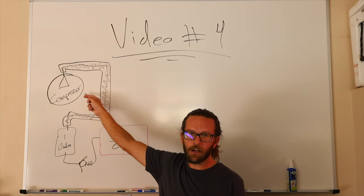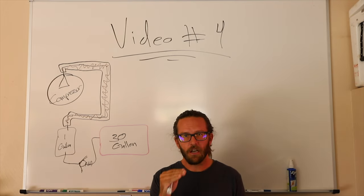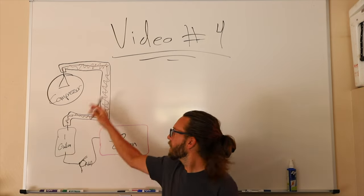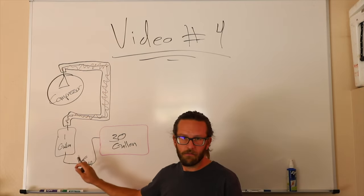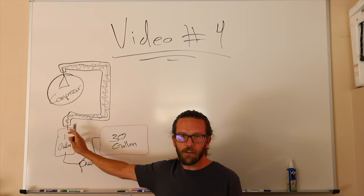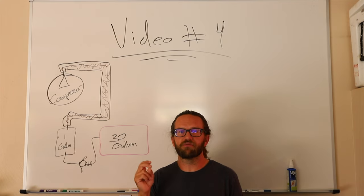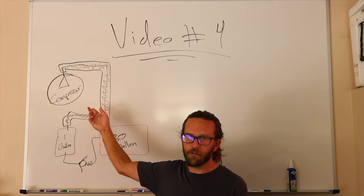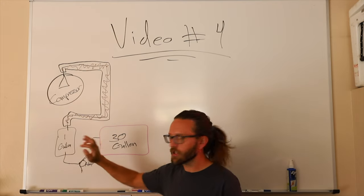So on that compressor, there's always a hiss. It's always. Until that valve goes down to load. Then it engages and it kicks back up. So, there's not much air volume in that hose. If you run straight to your check valve, you eliminate this bounce tank, your compressor's always gonna load, unload, load, unload, because it's sitting there purging your ounce of air, literally your ounce of air that's in that hose, okay? That's why I run a bounce tank.